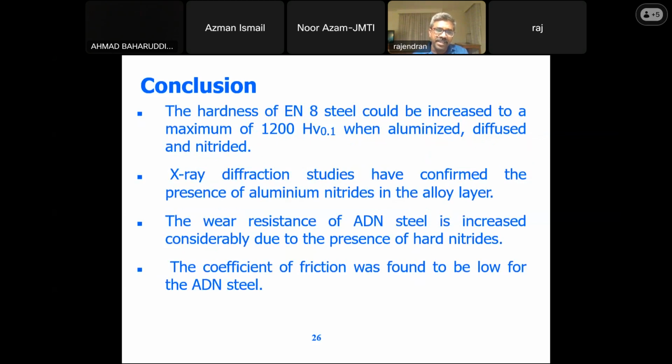And there are more problems wherein we have worked on exhaust applications, where we have been trying to choose electroless nickel coating also for improving the process. So we have done chrome plating, then nickel plating, and then aluminizing, and we have got good results, and we have done comparative studies. And apart from that, we have also done studies on the piston, wherein we have been trying to see how the thermal properties could be improved on the piston top, thereby it could resist the heat.